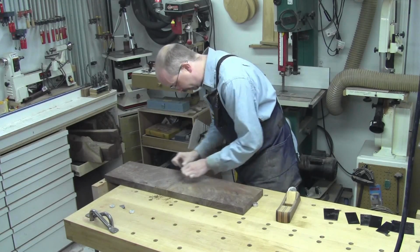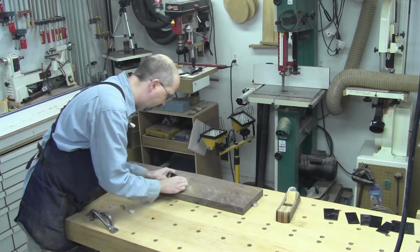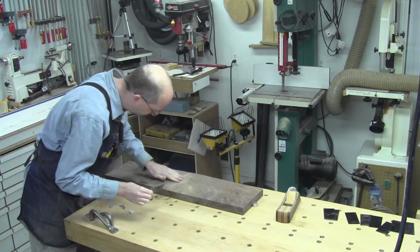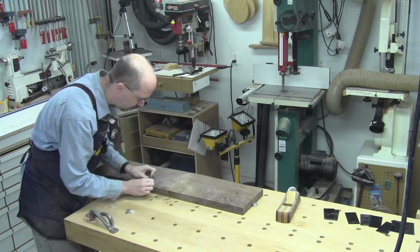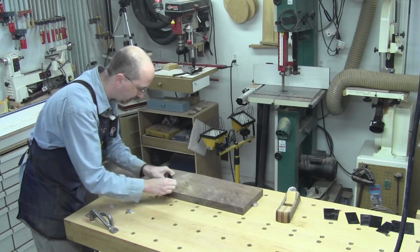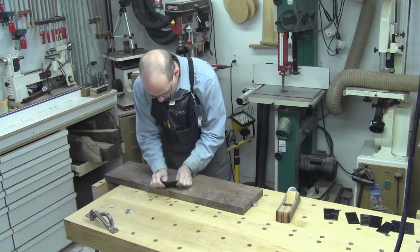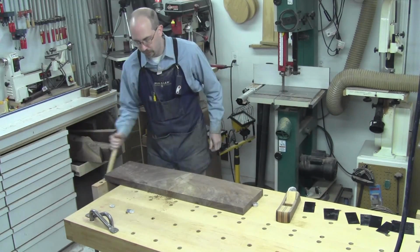And yes, I know I'm going across the grain. I don't really care. This is the underside, not the finished surface. I will say the glue line looks pretty good on the back, so that's even more promising for the front side. I made very little effort to make this glue line look good on the bottom side, so I think it might be time to sharpen a scraper or two. But now it should sit flat enough that I can work the middle section.